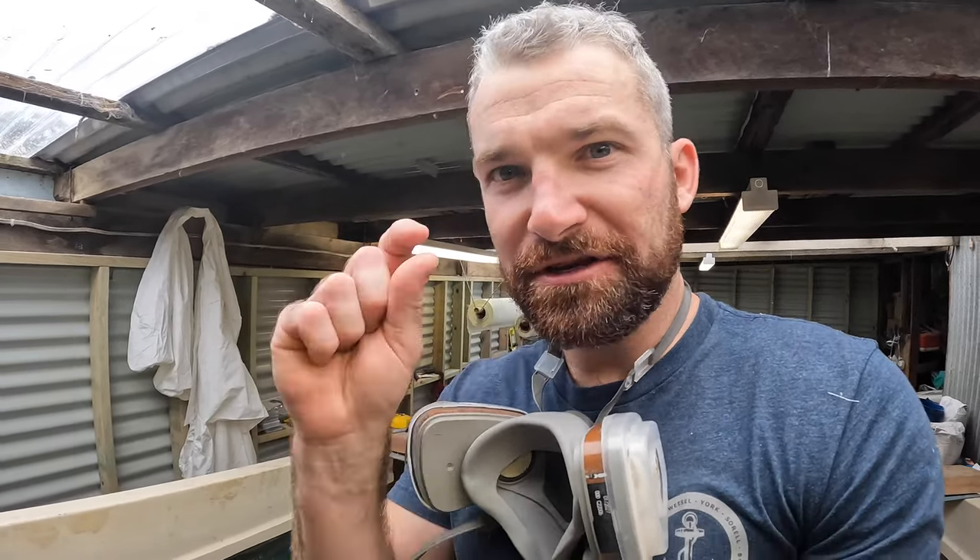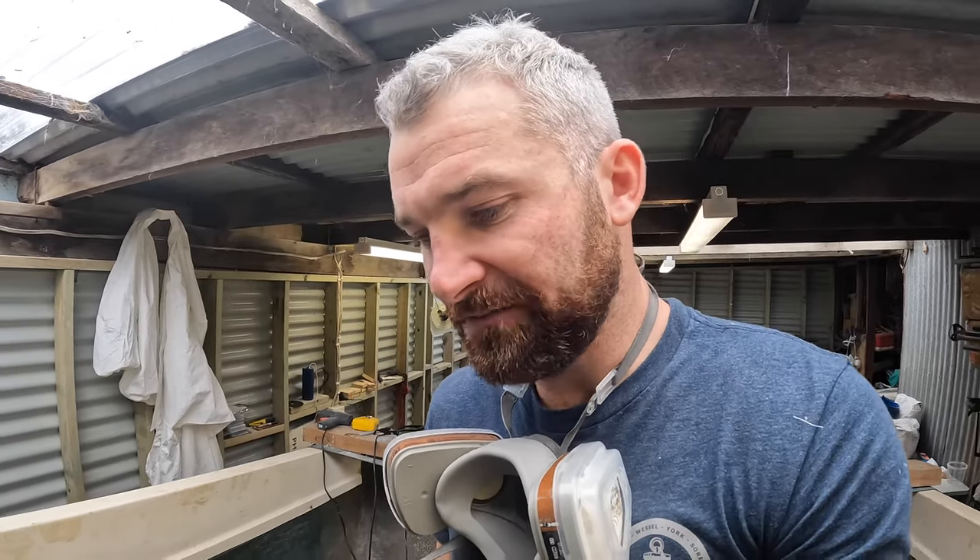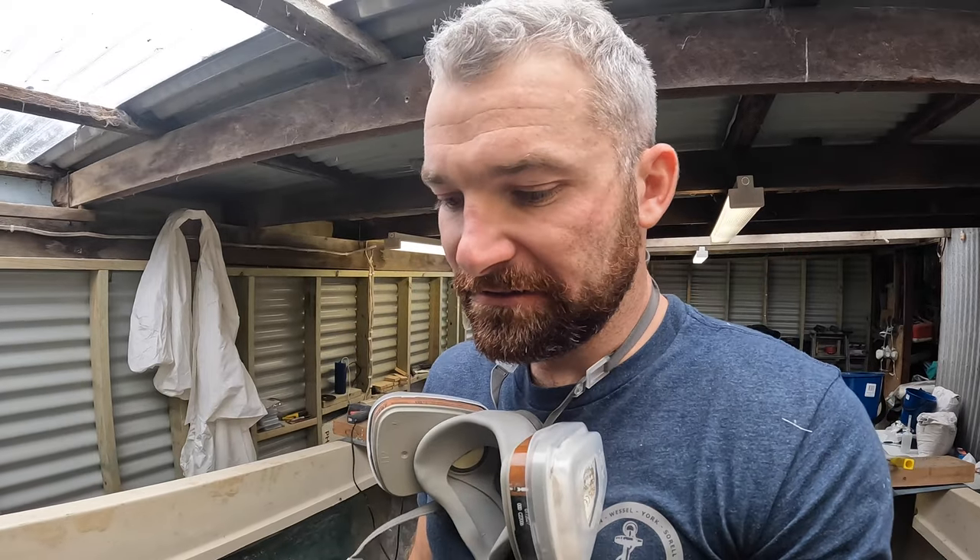From here, I've got a piece of melamine that I'm going to start laying fiberglass onto with some mould release wax, and that's what we're going to make our baffles out of. Rather than using Thermalite, which is a little bit thicker, we'll probably only have about five or six mil of fiberglass in the baffles, which is still strong enough, but it's going to give us a little bit more volume in that tank — so more fuel in there. I've calculated the tank to be about 350 litres, so it's going to be a fairly big fuel tank for a six metre boat, and it's going to put a lot of weight down low, lowering the centre of gravity and obviously going to help improve the ride. Alright, crack into this one.